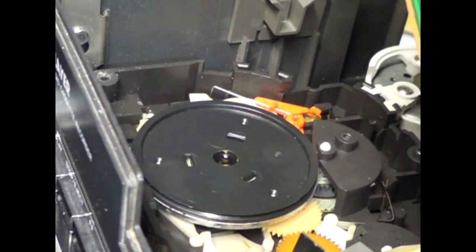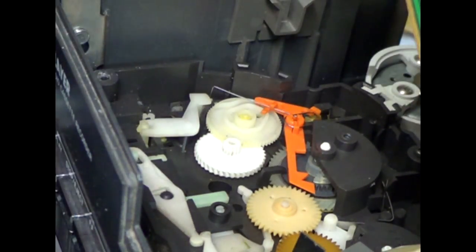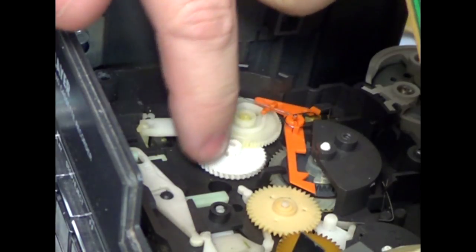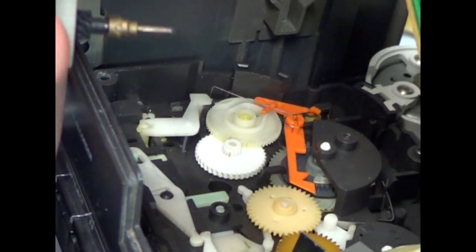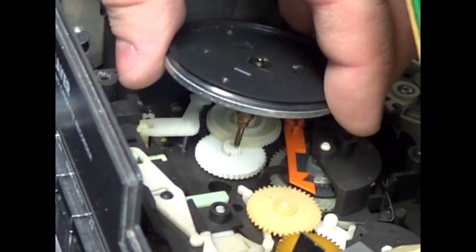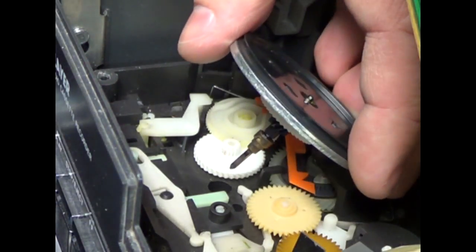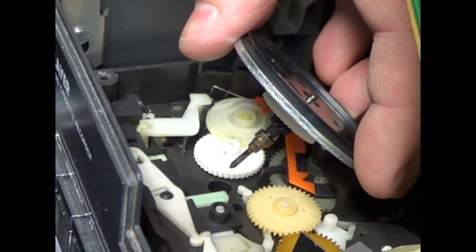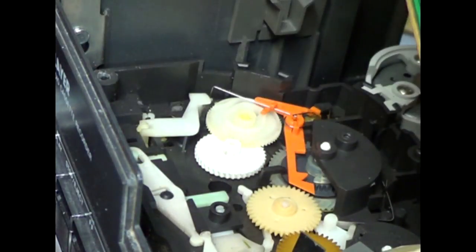Okay, now, you need to get to the gear. You have to remove this piece here. Now, this is a gear that I had already put in. I am going to take this one out to replace it with another one to test its fit. But you can see here, there are straight teeth, and then there's helical teeth. And they actually match up with the teeth on this gear. So yes, they do. Those are the ones it matches up with. So take this out, set it aside.